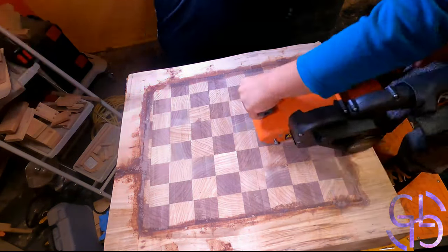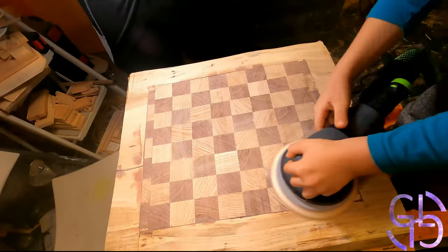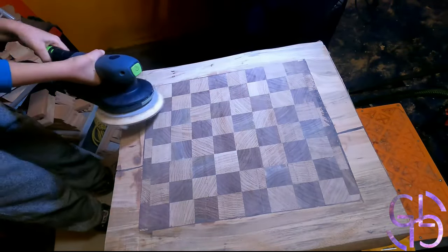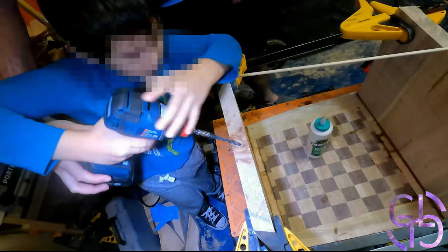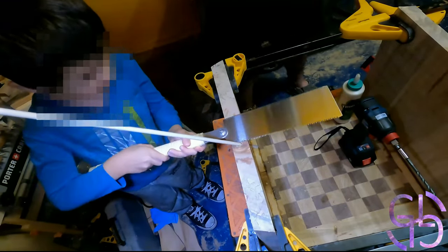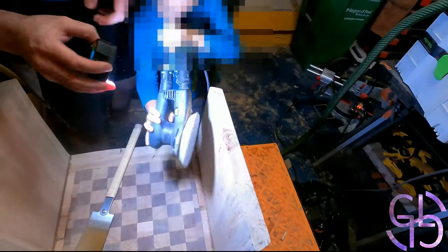Once everything looked good it was time to sand all the glue residue off. I was very scared to let my son use the belt sander since I sanded my own hand when I used it for the first time, but he was better than me having seen me screw it up. So he made sure to take it slow and easy, sanding until all the glue residue was removed and nothing but a smooth and clean surface remained. That's sped up a little bit, but it was one hour of sanding very, very carefully. The table was almost ready, but there was still one more problem — a huge hole going through the leg. This was home to about three dozen wood lice. After shining a bright flashlight and taking pictures, the hole was straight, so my son used the drill to widen the hole a little bit, put some glue, pushed a dowel right through, and then cut the excess off once the glue dried.